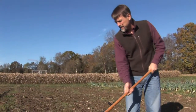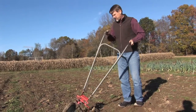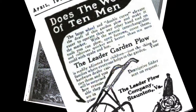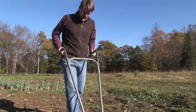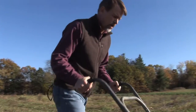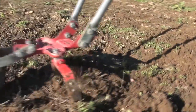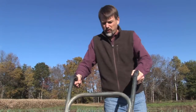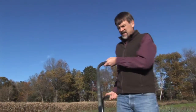Growers working with hand tools basically have technology like the wheel hoe that's been around for nearly a hundred years or so. Wheel hoes are really fantastic tools — they allow you to have a greater working rate than you do with a long-handled hoe, but it's very difficult to control your depth. If you just try to walk with a wheel hoe, you often go too deep and stop, or you lift up and get too shallow. Consequently, you have to take a step and then push to control the depth, limiting your working rate.